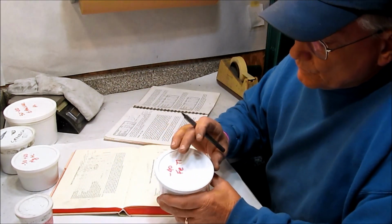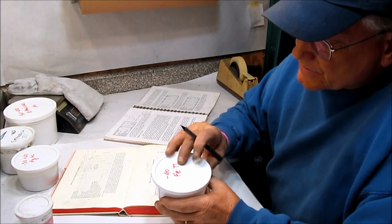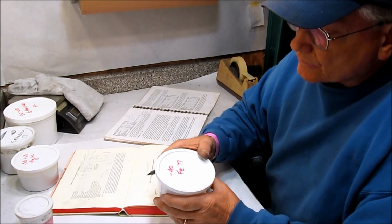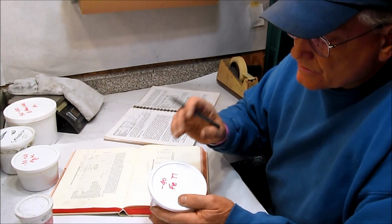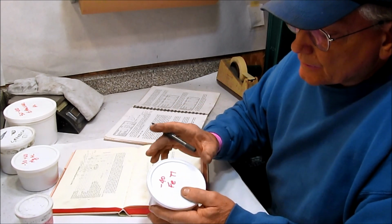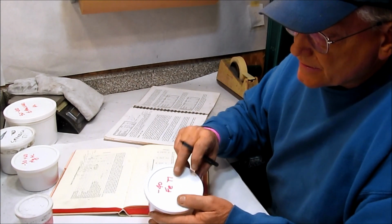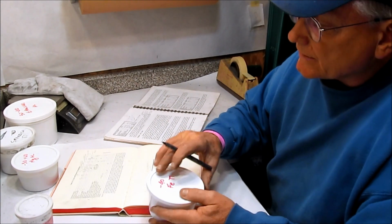The iron in the ferrotitanium is somewhat protected by the titanium, which is a non-rusting metal. So although ferrotitanium can rust somewhat over time and lose some of its effectiveness, it's less reactive than iron or steel because it is somewhat protected by the titanium in the alloy.